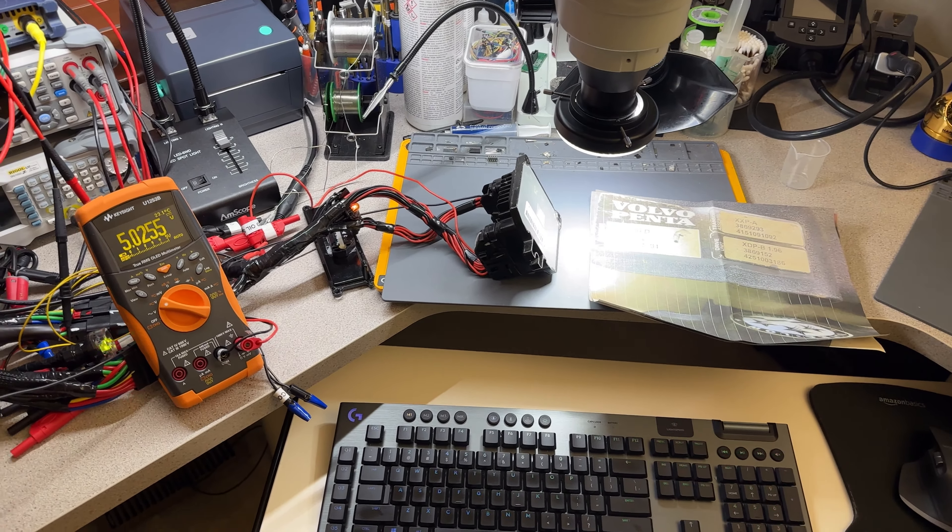On the faults, I erased the first one — he has a stop-tail set and now it has a crank signal fault that cannot be erased. So I'm going to open the computer and find out what we can see. I check my signals and the crank sensor signal is good — it's working. We can see it works, but again, this is something internally in the computer.